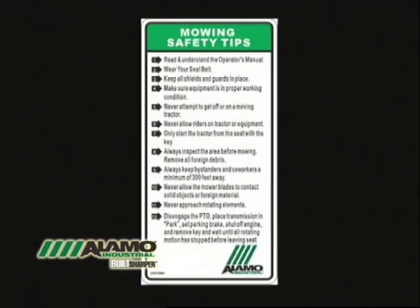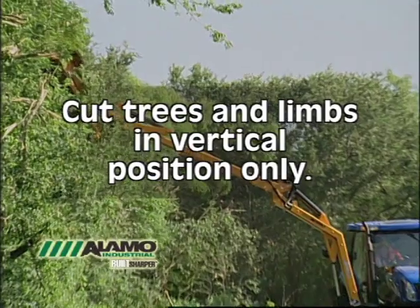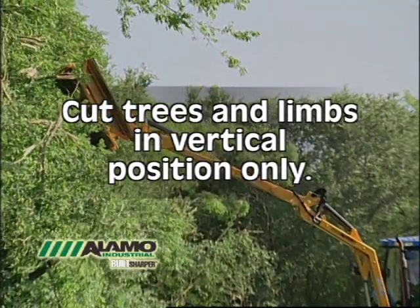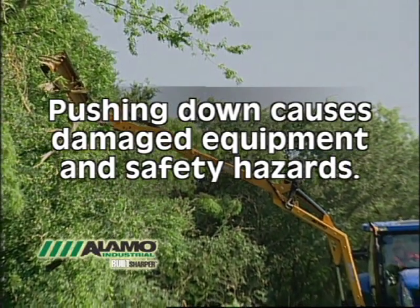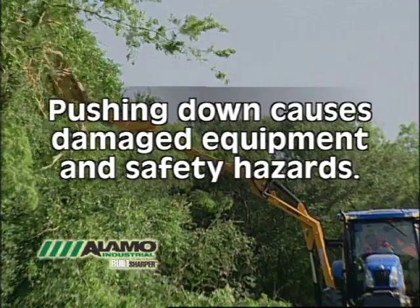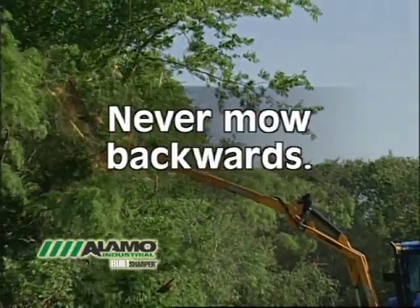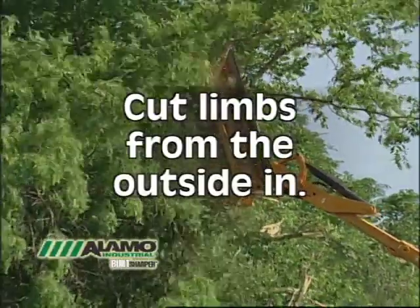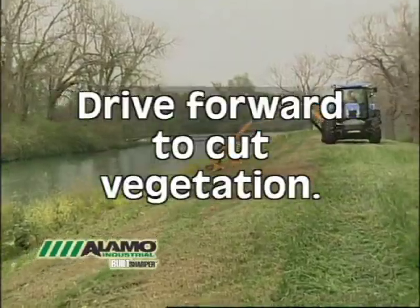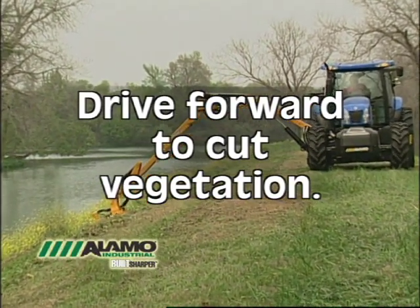Always follow the mowing safety tips listed on the decal located in your operator's packet while operating your machine. All mowing heads are designed to cut trees and tree limbs in the vertical position. Only grass should be cut with the head horizontal to the ground. Never place the head directly over trees or limbs and push down, as this will cause damage to blades and blade bolts and maximize the potential for thrown objects as well as machine failure. Trim trees and limbs starting closest to the ground and move up with each cutting path. Always mow forward into vegetation, never backwards. Limbs should be cut in approximately four-foot lengths at a time. Drive forward to engage the material with minor boom maneuvering. Stopping the tractor and moving the boom only is not recommended for continuous cutting and will cause premature wear and tear on your unit.